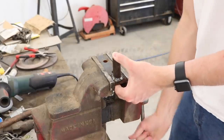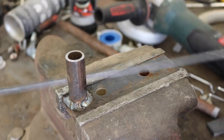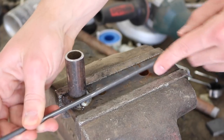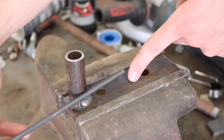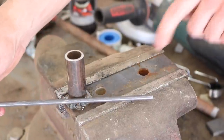I'll secure that in the vise, take the music wire and put it on, then start wrapping it around so we end up with a torsion spring kind of like this. I need to secure this end so that it stays put in two dimensions — firstly it can't whip around, and it also can't pull back. It'll have a tendency to wind that tail in and make it slip past whatever I have holding it.